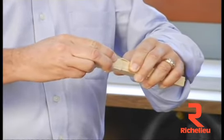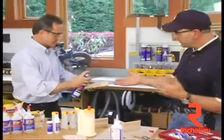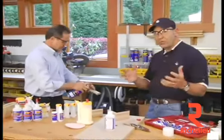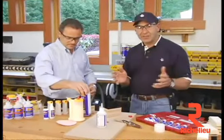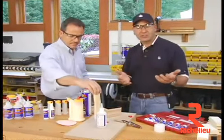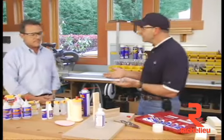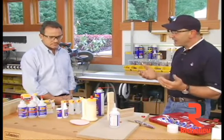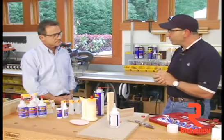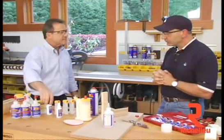We see that there's a lot of glue on here — a lot of excess. For the record, we don't want glue oozing out of the side because it's messy and it requires another step. But the nice thing about the glue is you can sand it — it sands perfectly. You can use it for filling holes and everything else. But the idea is to control the way you put it on, hence the gel. I see another product here which is the de-bonder.